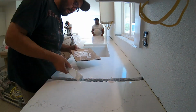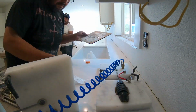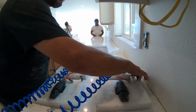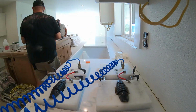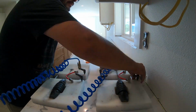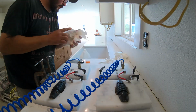Now, some time ago, in a video about allowable tolerances in construction, I asserted that there were times that in construction you're working to thousandths of an inch. You know, 10 thousandths, 20 thousandths. And some of you took me to task on that. Well, I can tell you that in fitting joints in stone countertops, you work to within thousandths of an inch. Now, not 1 or 2 thousandths, but probably 5 or 6.